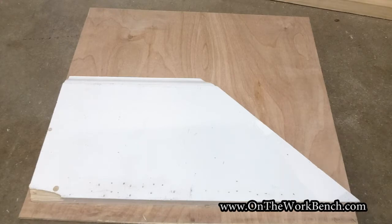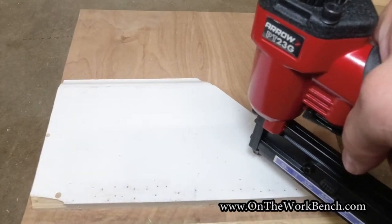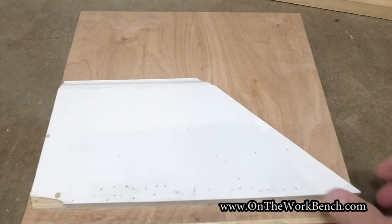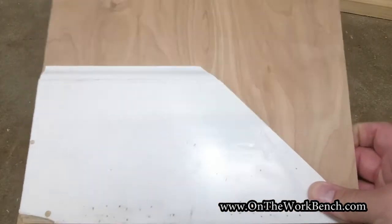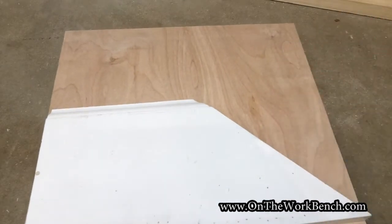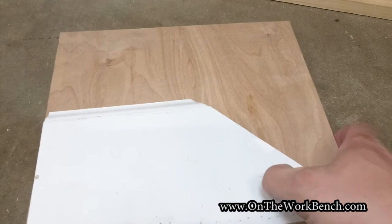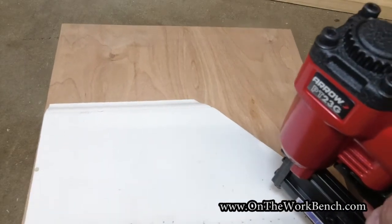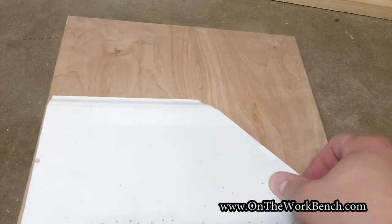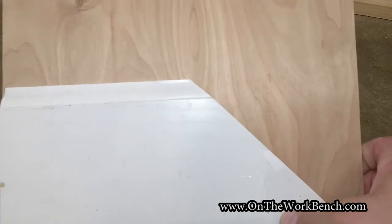This is at 60 psi. All right, so once I rub the little red piece away, this tucks away rather nicely. Let me try one more. Okay, you can clearly see that one. That one's actually just a little proud. Maybe I should have a little more pressure on it. Let me try one more. That's nice and flush. Still a little more visible than I would prefer, but far better than what I was getting before.